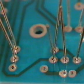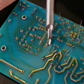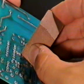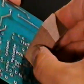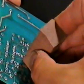First, let's look at the essentials of a good solder joint. The circuit board pad, the component lead and the tip of the soldering iron must be clean and shiny. Tarnished or oxidised metal won't take solder no matter how long you heat it. To clean the pads and tracks on a circuit board, use an abrasive rubbing block.